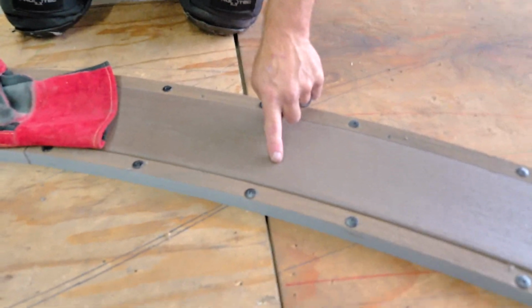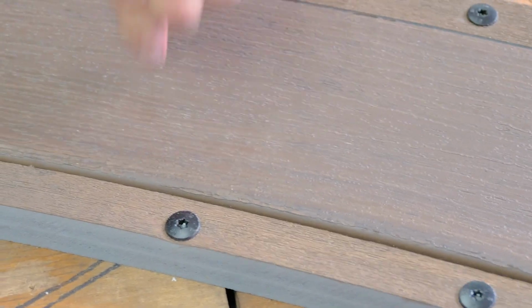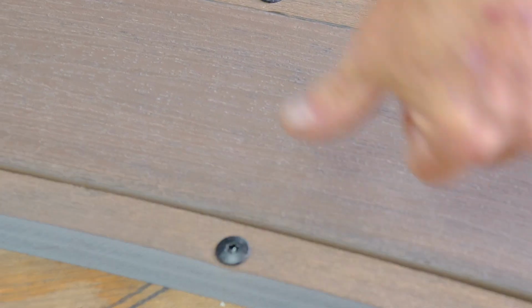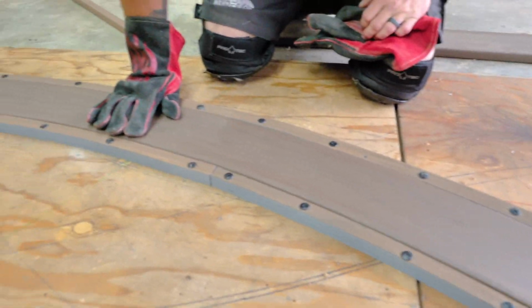All right, so this board got really hot. The thing about HeatCon silicone heating blankets is you have to use 2 10-foot kits to heat a 20-foot board. It's really hard sometimes to keep both sides of the board at the same temperature. One side was running a little hot this morning, and I'm gonna take my finger, and you can see how pliable this decking is right now. I could actually ruin it by pushing my finger into it. So you got to be careful when you're doing this type of work that you don't overheat the boards. We were pushing this one to its threshold. It had a couple small blisters on the bottom, but it's looking good.